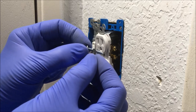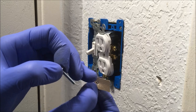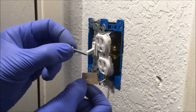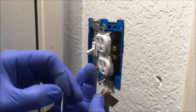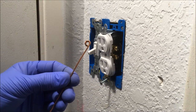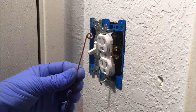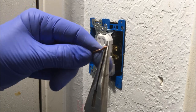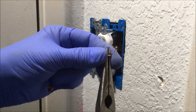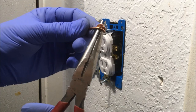If you lose the little keepers that go on the screws for your outlets and light switches, cut a little piece of cardboard, punch a hole in it with an ice pick or something larger so it fits around the screw tightly, and it'll do the same thing for you that the keeper will. You can also use copper wire to bring out a recessed outlet or light switch. Here's how I made that loop: use needle nose pliers and just wrap that wire around the needle nose however many times you need.